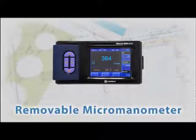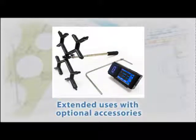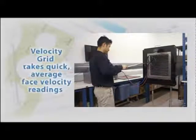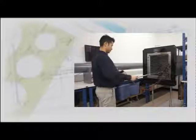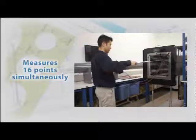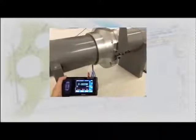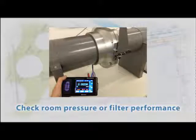Another feature of the 6715 is that the meter also functions as an independent micromanometer when removed from the hood, and can be used with several optional accessories for additional applications. The velocity grid is a cross-shaped attachment that allows you to quickly take average face air velocity readings, measuring 16 separate points and reporting the average to the meter. When coupled with a pitot tube, the micromanometer can perform in-duct air velocity measurements at high resolution. Adding differential pressure tubes allows you to measure room pressure or check the performance of air filters.